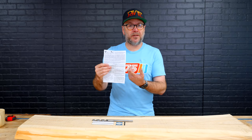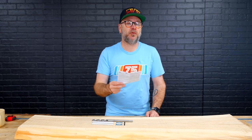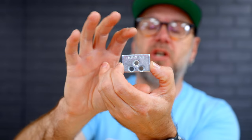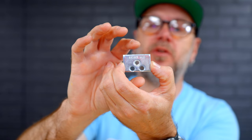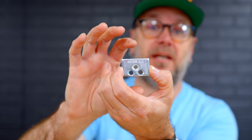I'm going to show you the proper way according to the instructions that came with the hardware, and then I'm going to break all the rules because I have a special situation that needs a few adjustments — we'll do that at the end of the video. These supports will hold a hundred pounds at four inches deep or fifty pounds at eight inches deep, and the more supports you add, the more weight it'll hold. The shelf needs to be at least one inch thick to hide the support. You can go much thicker, but just know that will take away from some of your weight capacity. Finally, the shelf needs to be at least 18 inches long so it can fit on two 16 inch studs.